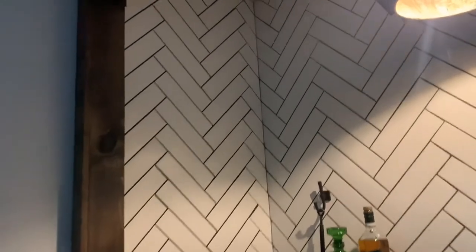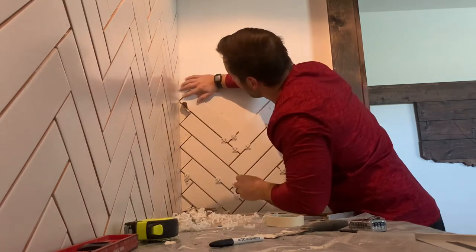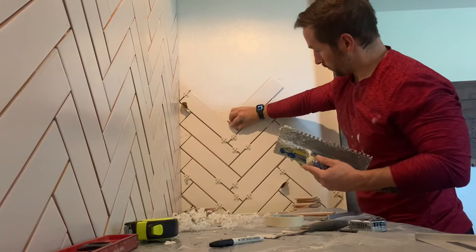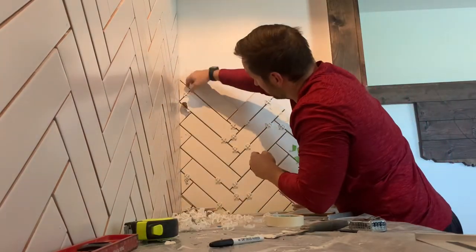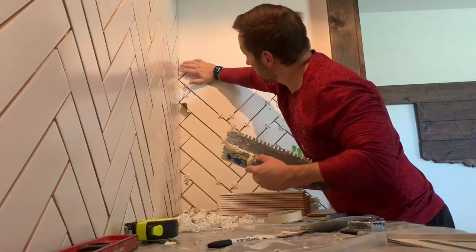This is just a quick look at throwing up the tile — I'm not going to spend much time on basic tiling technique. Once you start going, it's all repetitive: one tile goes on top of the other at the angle, then one comes over the edge of that, and so on. It's like any other tile, just at that angle. On the non-plumb wall, I ripped some cardboard from the tile box and folded it up to help match my lines as they turned — it helped me match everything up the best I could.